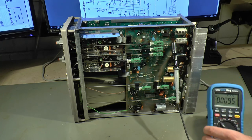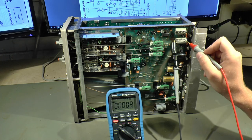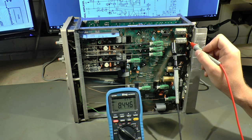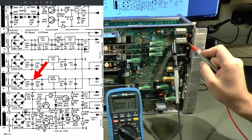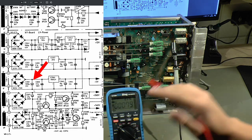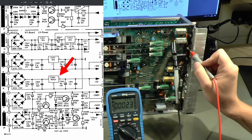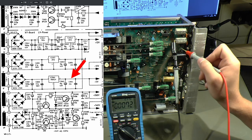Looking at the manual shows us that the top capacitors are input smoothing capacitors coming straight from the bridge rectifier going to the regulators. One of these says it has a 7.8 volt AC winding rectified going to capacitor C2061 here. Rectifying 7.8 volts with some tolerance does get us to around 8.4V, so this reading is probably fine. Underneath we have the 5 volt regulator — tracing the circuit further there's just a nice little jumper on the board which we can measure, and we see the 5 volts is fine at 5.06V, perfectly within margin.